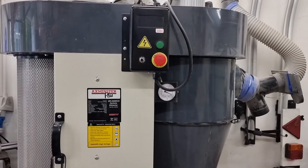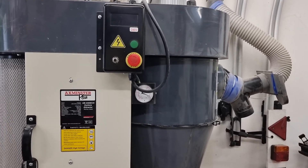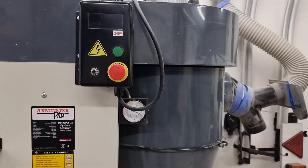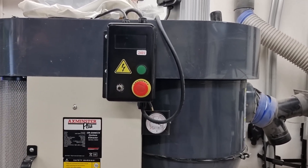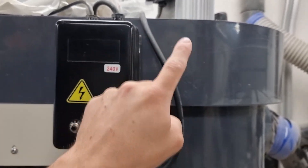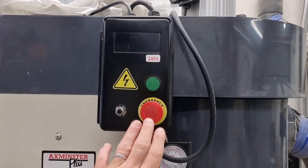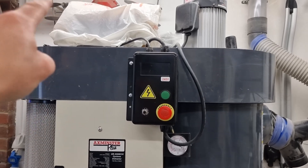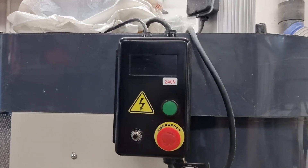Now, if we were to control this via the CNC, each time you do a job or change a bit, you'd turn this off and the bellows would start cleaning themselves. I want to avoid that because I don't know how many times that thing can spin round without wearing the inside of the filter out. So I want to minimise that as much as possible. At the end of the day I'll hit the emergency stop and that will trigger the cleaning cycle.